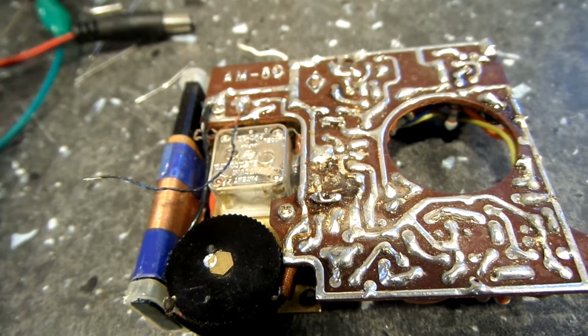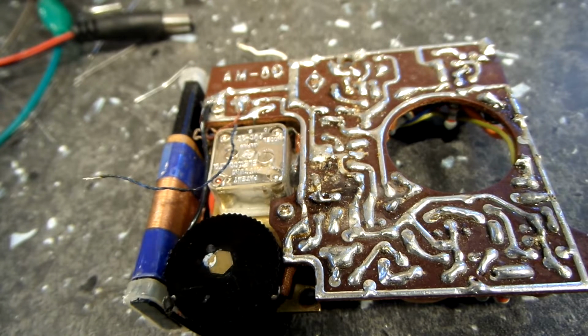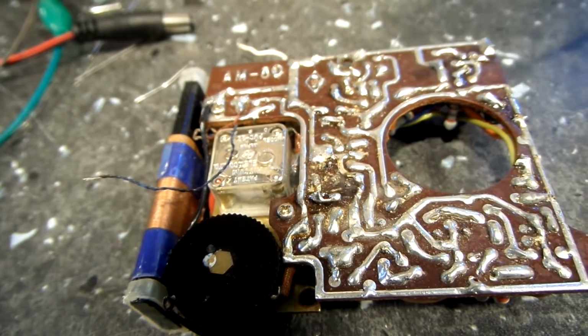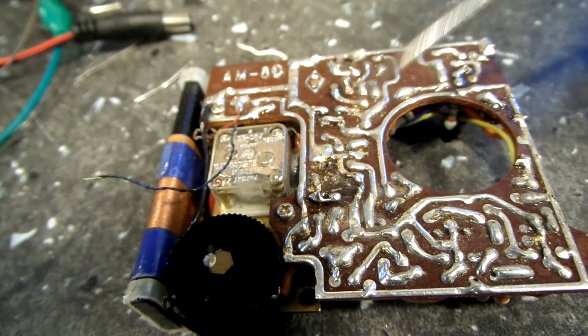Alright, we are back once more. I do have the transistor from the brown radio removed. And just for the record, it was an NEC transistor, a 2SA285. That's the one they replaced the original 2SA160 with in the brown radio. This is the original transistor that was in this radio when I got it, and this is the one that did work in here.